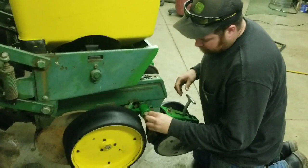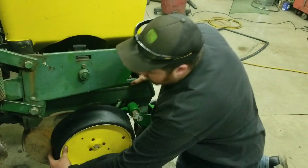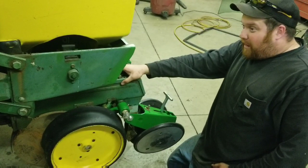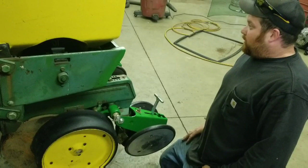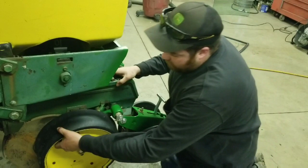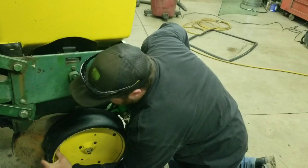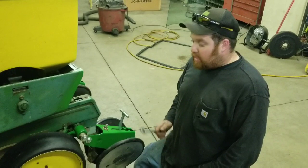If you farm fluffy muck, you want these as fairly tight as you can get them without having them too tight. From factory, when this planter was new, they said to slip a business card or a playing card in between here and that set the clearance. But this planter is probably 25 years old, been over a lot of acres, so that doesn't apply — plus we're using already used gauge wheels. All you really have to do is make them so they just make contact with that disc opener. You don't want them to squeeze too hard, but hard enough that it keeps debris from getting caught in there.